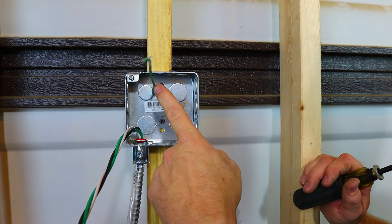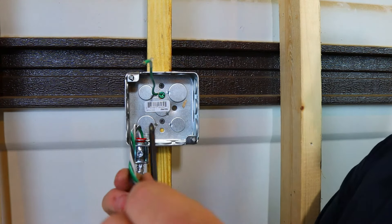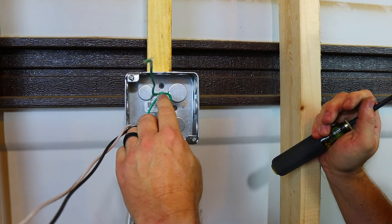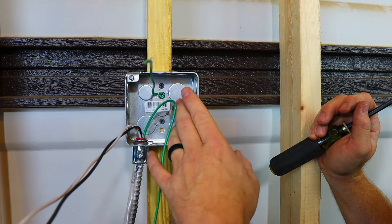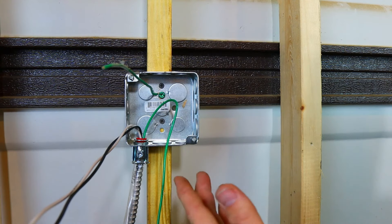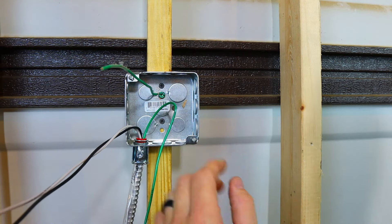Make sure that the hook is oriented to your right so it tightens as you screw. Slide it over the screw and screw it down tight. You have your ground wire and then your main bonding ground — this is the wire that bonds the ground to the metal box. Never wrap the incoming ground wire directly around the screw; if it ever breaks, you've lost your bonding to the box entirely.